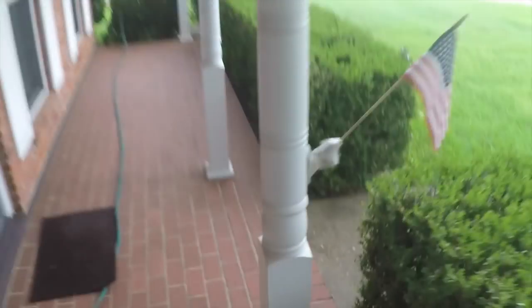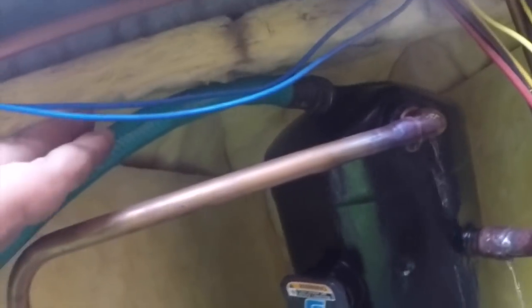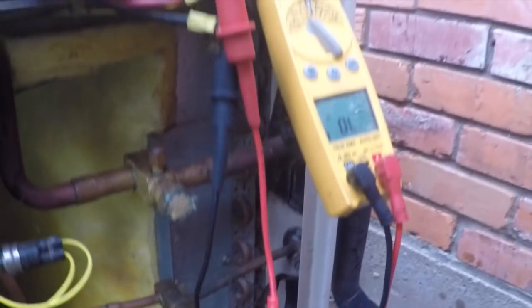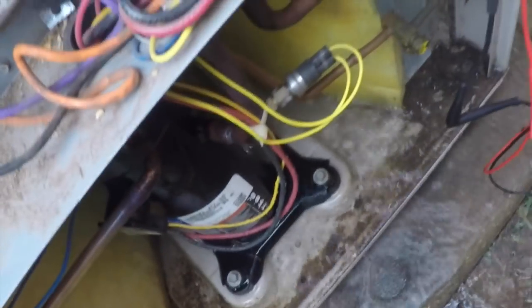Okay, I have the water open. Alright guys, I've got water going on the top of the compressor — keep sliding off, trying to get it to stay. The meter still has not toned, we still have open line. We're just going to sit here and wait for the meter to tone out and then restart the system. Alright guys, you can see we have ohms now — we have 1.1 ohms. The compressor has closed.